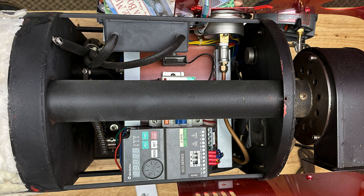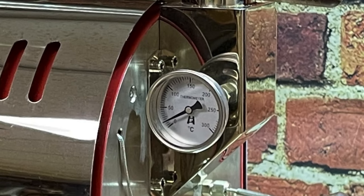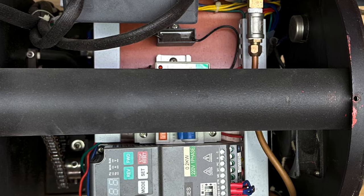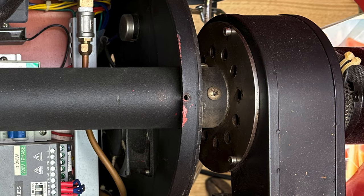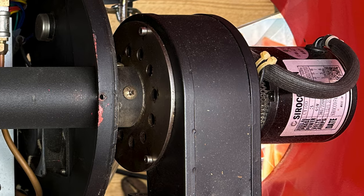One last component is the tube that runs across the top of the roaster — the exhaust tube. At the front top of the roaster there is a chrome box, and hot air from the roaster goes up through an opening there, exhausts through that tube across the top, and then goes through the fan unit which draws the air. The chaff falls down into the chaff collector, while smoke and hot air go up through the venting system.